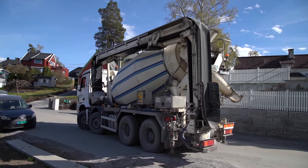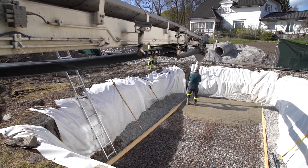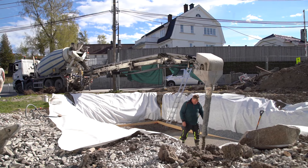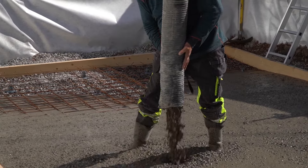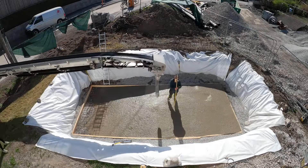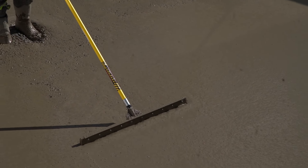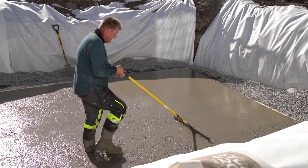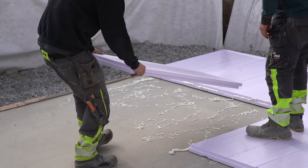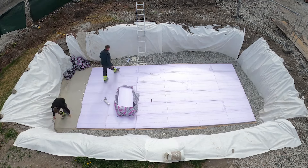Step four: now it is time to add the concrete. Make sure to water the foundation before pouring. Save yourself time and money by letting a concrete truck do the job for you. We got B30 concrete with additional flow because it is easier to work with — the higher the number, the stronger it is. We added 20 centimeters of concrete, resulting in six cubic meters in total. To prevent air pockets the air must be released from beneath by gently vibrating, followed by leveling and smoothing it over. Remember to keep the concrete wet to avoid cracking. We then added XPS plates for insulation to keep the heat from evaporating and save on the electricity bill.